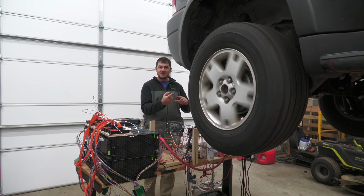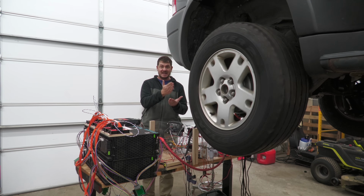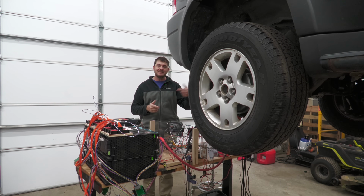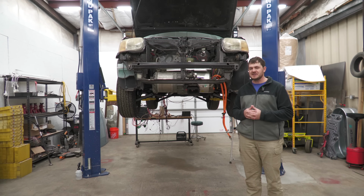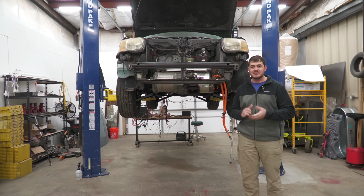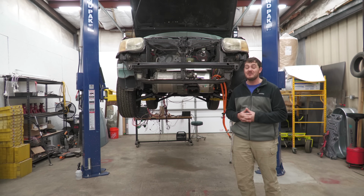If I flip the direction of the motor so it's spinning the correct way, it becomes drive that has instant throttle response and reverse that's severely deadened. And that's a problem because the front motor is mounted backwards. I could have sworn the throttle response in the correct direction on this front motor wasn't like that before, but it doesn't matter because it's like that now. So I'm talking with tech support about this issue. Not AEM tech support, the tech support of the company I bought the VCU from. We'll see if they're better.